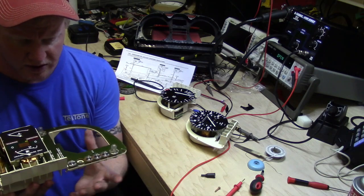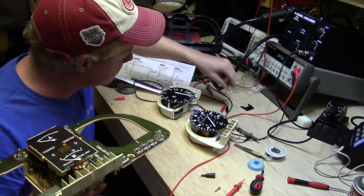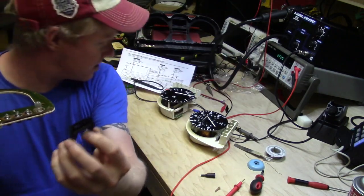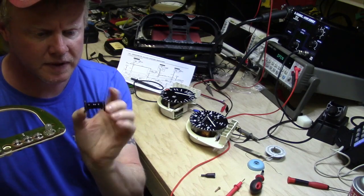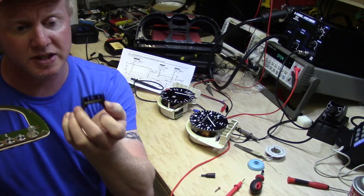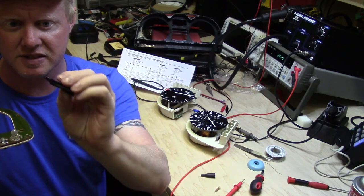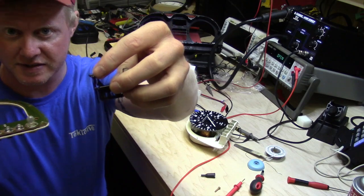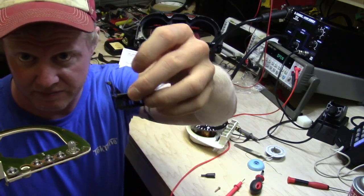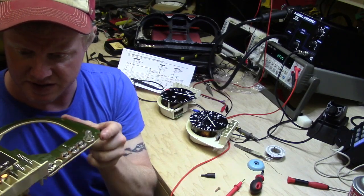We've got this apart. Really the only thing you have to do is there's actually a stationary plug that goes in the slot — this would be on the tachometer. Generally this actually sets the tach sense speed. This one's got an O3 on it, and I think basically the same tach module can be used for several different cars depending on how many cylinders it has.